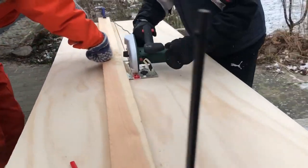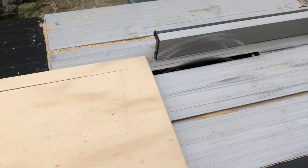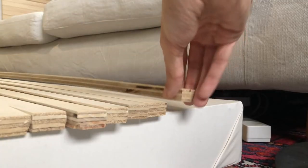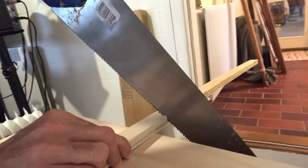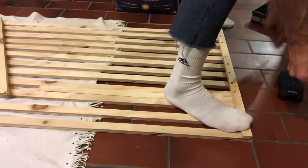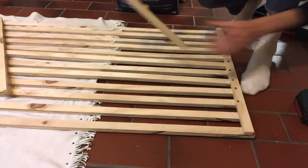Here's how you build slats: make them the same height as the acoustic panels, then cut out 28 millimeter wide wood pieces. For each of my slat walls I cut out 12 pieces to fill the full width of the panel, and I made the space between slats the same as the slats themselves — 28 millimeters of wood and 28 millimeters of space. Then cut some vertical pieces to go behind the slat walls.